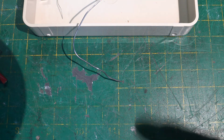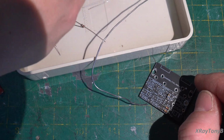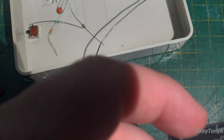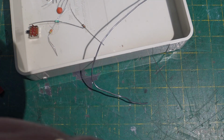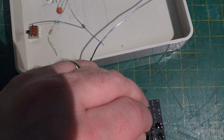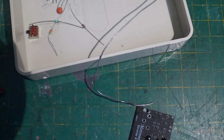Okay, so let me put the next one in. And there should be 2 of each resistor because this is a 2-channel. This is stereo. And put the next one in. And again, if you're not good at your color codes, you can always use your ohm meter and just measure the resistance. Or if your eyes can't see, like mine, a lot of times it's hard to see these tiny little bands on these tiny little 1/8 watt resistors.